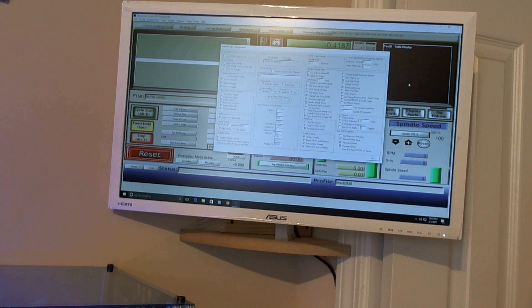If you go into your general configurations, you will see an option all the way to the right called 'Use Watchdogs.' If that's not clicked, the charge pump on the Gecko G540 will stay in its default position. Once you click it, it will go into the powered position with the emergency stop released.